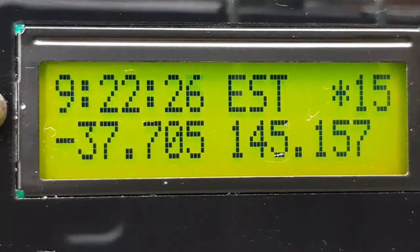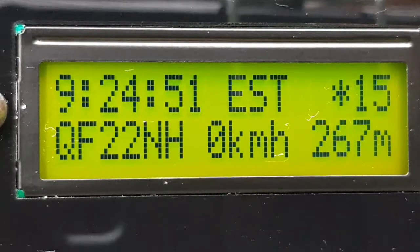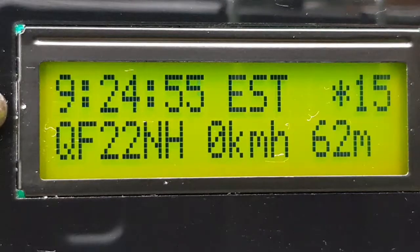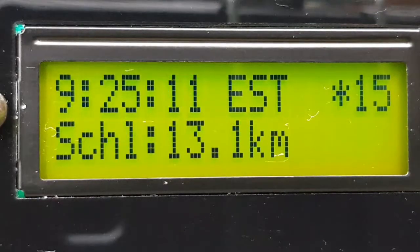I've had to take this right outside to get a clear view of the sky. Once you've got longitude and latitude you can pass that information through to some algorithms. The first item on the bottom row is grid square, then I'm displaying speed and altitude. You can also calculate distances — for example, the distance to the suburb of Blackburn is 13.7 kilometres away. You can calculate distances using the Haversine algorithm: the distance between two latitude and longitude pairs.